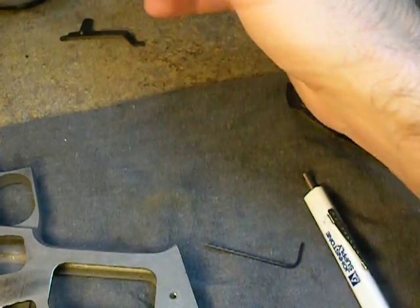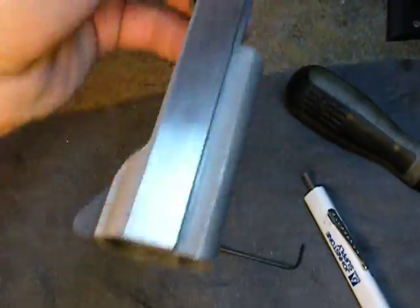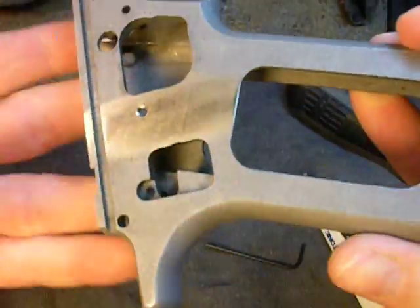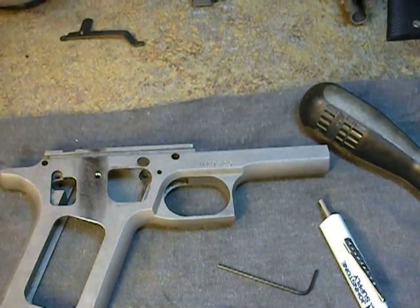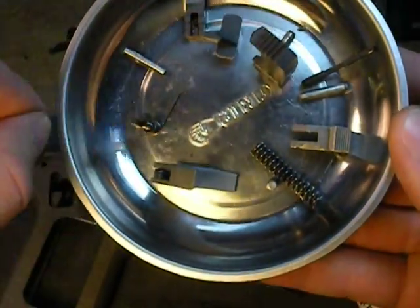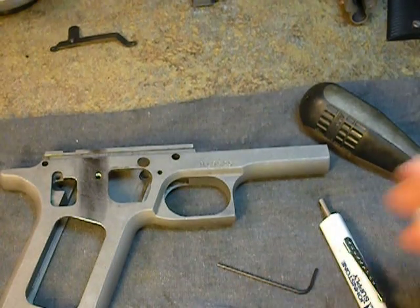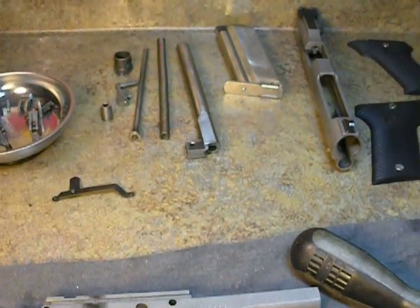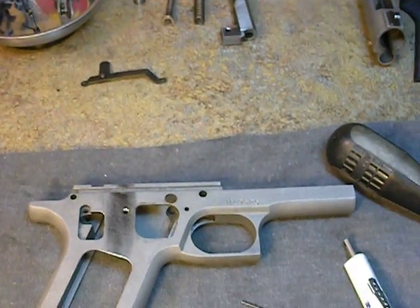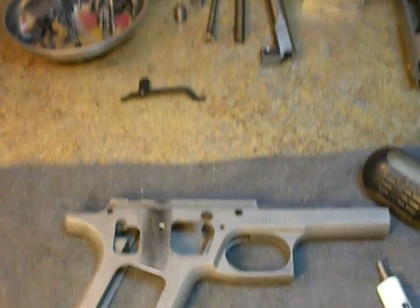That is the complete disassembly of the AMT Auto Mag II. We now have a completely stripped lower and upper slide, except for the firing pin and safety, which are very difficult to get out — so that is as far as I would choose to go. You can now paint this gun, oil it, clean it, and see all the internals. Here are all the appropriate parts — you can see all the little springs and tiny pins. In the reassembly video, I will probably already have the sear and magazine release in place, because you cannot get them in on the first try no matter how good you are. Thank you very much — please comment, rate, and subscribe. Happy shooting and gun safety.